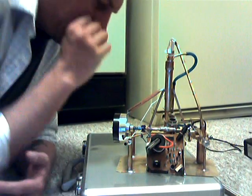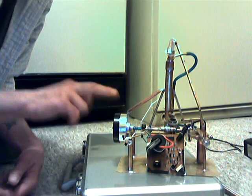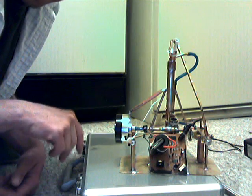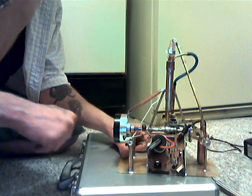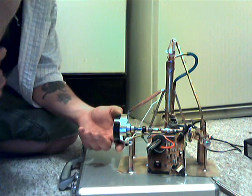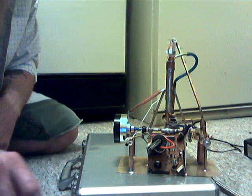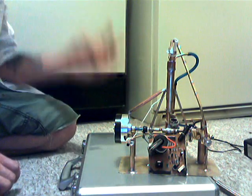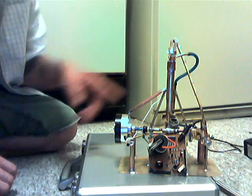I need to hook my lawnmower battery back up. The timing on this thing is set up to work best with oxy-hydrogen — it doesn't run like an air motor with the pressure I have. If I had higher air pressure, maybe from an air compressor, it might work as an air motor. But the timing is off. The gas valve that injects gas into the chamber opens just before TDC because there's gonna be a vacuum in there, and I wanted the system to have time to inject gas in light of that vacuum. All the gas gets burnt out of this whole area, so it has to refill before a gas shot gets sent back up in there.